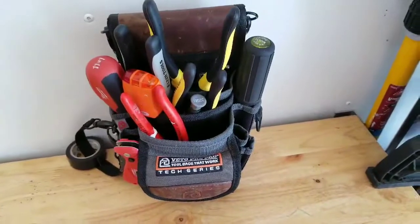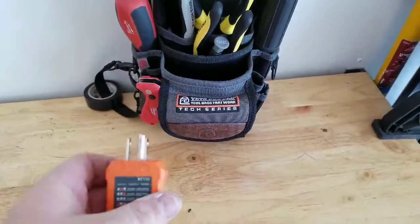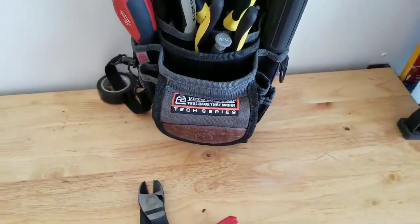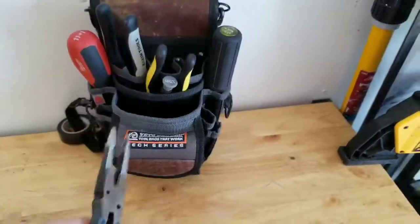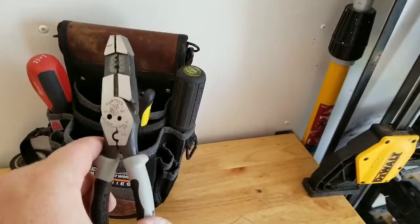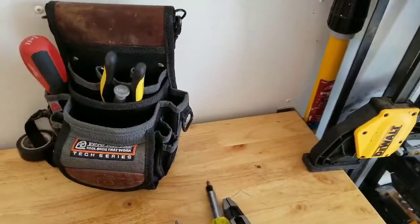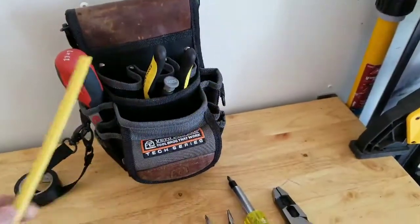Just do this at your own risk. For this project, not limited to but what I use: first off, some cutters. You're going to need an electrical tester, some sort of electrical way to test light, a knife to cut Romex, and some wire strippers. I use these — they cut and strip, but any type of wire stripper works. You're going to need a wide-head tool, either linesman pliers — this is what I'm going to use today — something wide so I can twist wires. A screwdriver multi-tool, 11-in-1, very handy. And electrical tape. And also for this one, you're going to need some Romex. Alright, let's get to it.